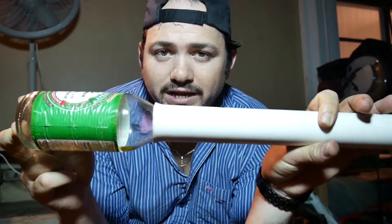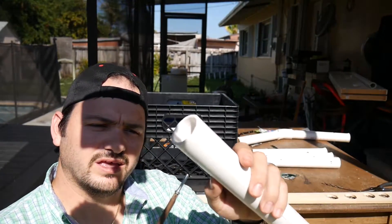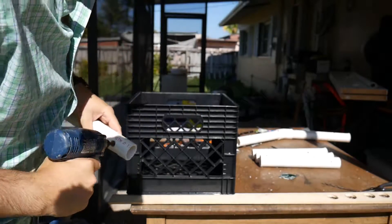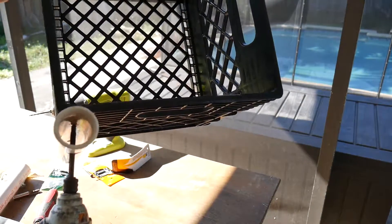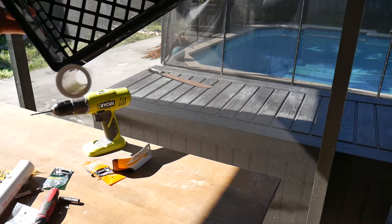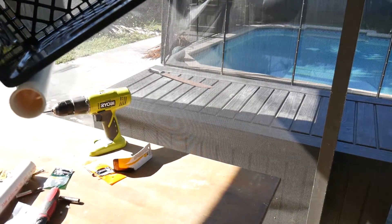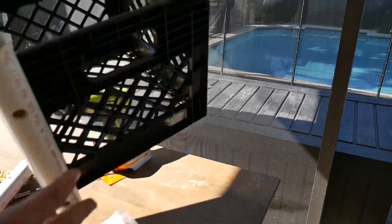So let's drill the hole. A little trick I discovered: get the bolt and put it through like that and hold it so it goes through the PVC pipe to the end, because there's no way to hold it inside otherwise. Just hold it like this with the screwdriver — the head of the screw is there. It shouldn't hurt the rods; inside it's just a minor protrusion, not a big deal. With those locking nylon nuts it's really tough and it's not gonna go away — it's gonna last you longer than if you use just zip ties.